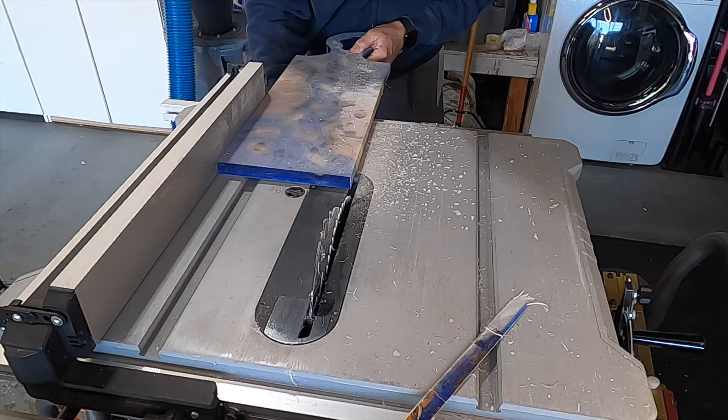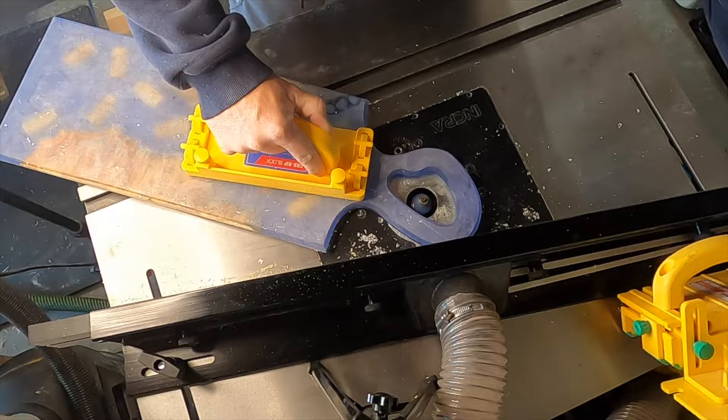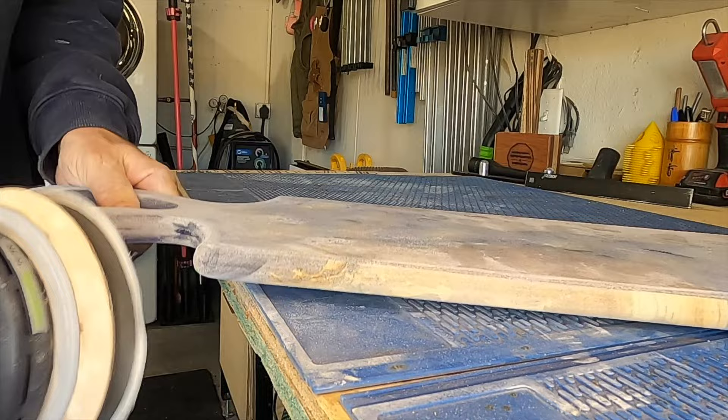Before adding a round over I'm just going to take a little bit of epoxy off both edges. This will ensure we have clean sides for the round over bit to follow. At the router table I'm going to start with shallow passes, build up the contour to what I'm looking for, then shape the final profile with my random orbital sander to get nice rounded edges. I have a soft pad installed on my random orbital sander, which allows me to follow the contour of the round over and make sure I'm not getting any flat spots when building in that contour and finishing this epoxy board off.